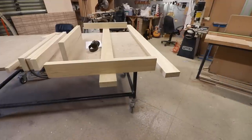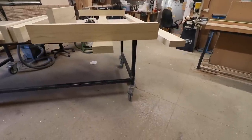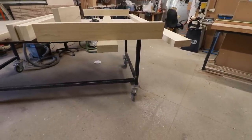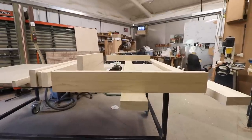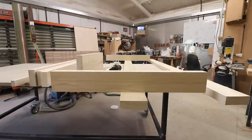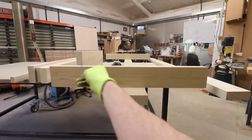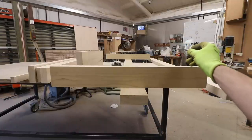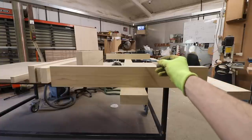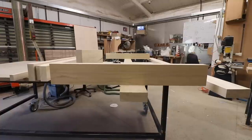Then you just lower your vision against them two pieces and you check the wind on them bits of wood. So here we go, we've set the tripod up. Hopefully you can see as I lower it down, looking for this edge here where the edge of the timber finishes. We're looking against the bottom edge of that panel there. It helps in this situation because we've got that nice dark background to look against.